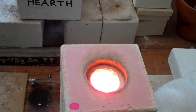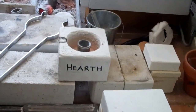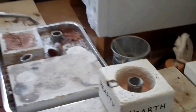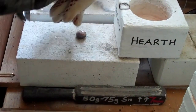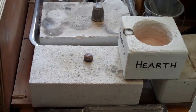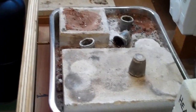You can see there's still plenty of heat in the furnace, so I'll pop the lid back on. After quite a short time the metal will solidify, and there's our little mini-ingot of bronze. That's now refined metal as far as we're concerned — we've put some flux in there when we melt it down to make into a ring or whatever. That is the little ingot that will typically go on to make a ring.